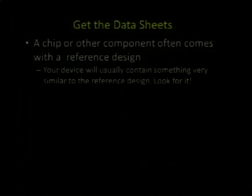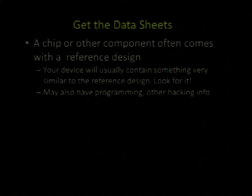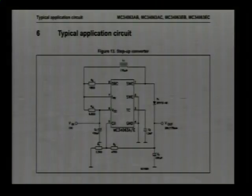And it's got some other cool stuff, reference designs. You look for those. Designers are pretty lazy, and they like to reuse something that somebody else already had a team of engineers spend thousands of dollars developing for them. So you'll find stuff like this. And if I know that chip design is something that looks like that, then I go over to my circuit board, I'll bet I'm going to find all those parts. In fact, I'm often going to find the exact model part that was used in that reference design, because somebody didn't want to spend an extra day finding a cheaper or better substitute. And it's also going to tell me where I might be able to change stuff. In this case, the four resistors, I think specifically R1 and R2 at the bottom, set the voltage that's going to come out of that thing. So if I want to turn the 11.1 volt power supply for a Belkin 1995 USB hub into a 13.8 volt ham radio charger, I know where to start looking.